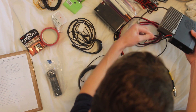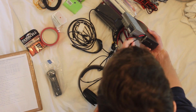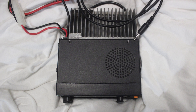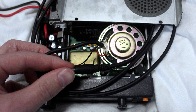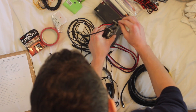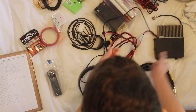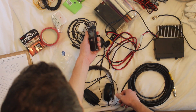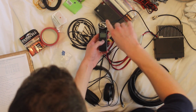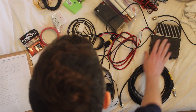I've got this audio cable coming out of the radio, which is how I record the audio. I wire that directly into the speaker terminals rather than using the external speaker out — this cuts off the internal speaker so I can't hear it as easily. I have to turn the volume down really low because when I connect it to my recorder — a Zoom H1 — the audio goes so high it becomes distorted. So I turn it down really low and nobody can really hear it unless they get very close.